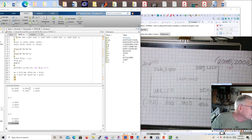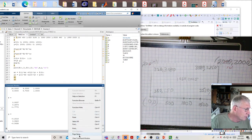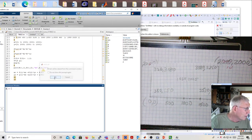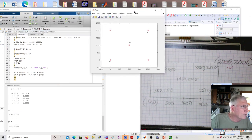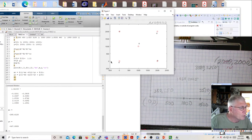So let's run this. I'm going to clear this down here. Let's see. Oh, sorry. Clear. And now we're going to run it. So we're plotting out. Now what you can see here is our scale goes from minus 500 to 2500. So we're really interested in 0 to 2000 and 0 to 2000. So this is our idealized map. And our red circles are the idealized points. And the boxes are where our raw values are actually mapping to. Now that one's right on. That one's right on. These are pretty close, not bad, and the center's a little off.